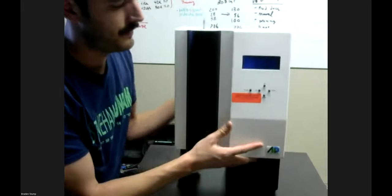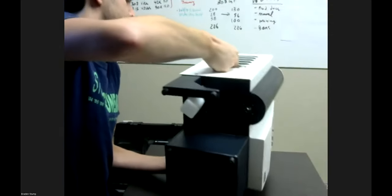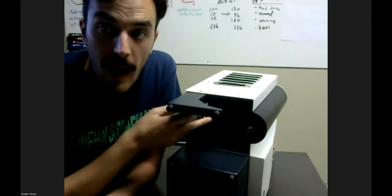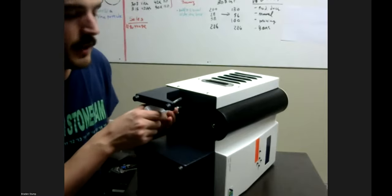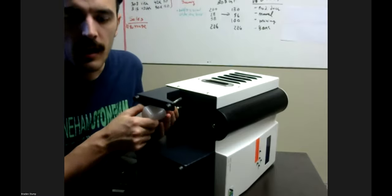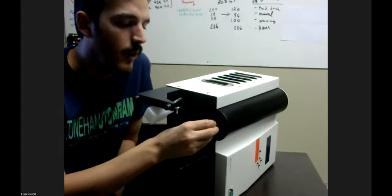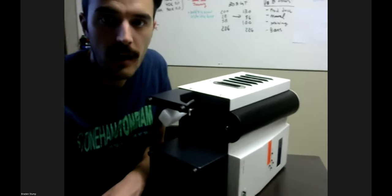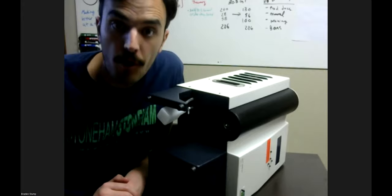Looking at the bottom of the instrument: you will see a trap bottle with an inlet on the inside facing the instrument. The trap bottle, as shown in the flow path, is right after sampling into the liquid vial occurs. If there is any liquid in the trap bottle, that means the sample has overflowed from your liquid vial and is being blown out into the trap bottle. It's a protective measure — if you see liquid in here, something has gone wrong, and it's a nice indication of error in the system.